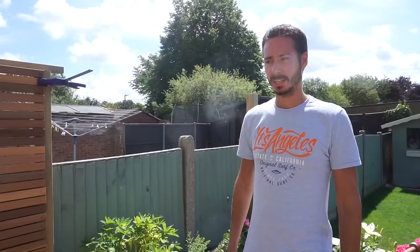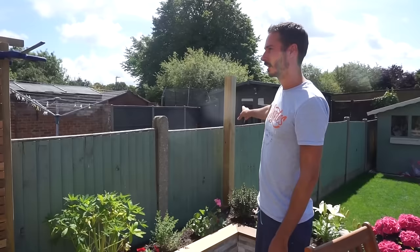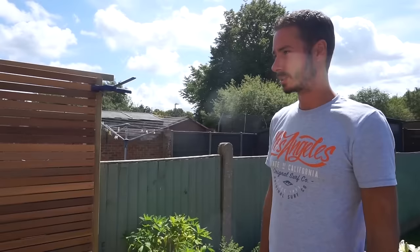We've put this screen in place without screwing it in so that I can make sure the distance from here to the end of this post lines up with this edge, because this post won't be perfectly plumb. So we'll wiggle this back and forth and then screw another batten across the top when they're both plumb, then measure that gap again — and that's the length we'll cut the next battens to. Then we'll just repeat the same process for the next one.